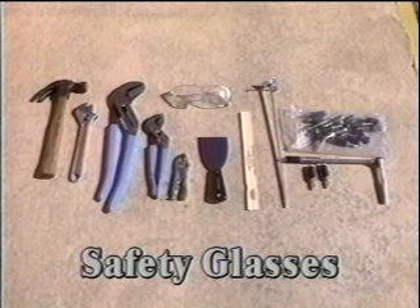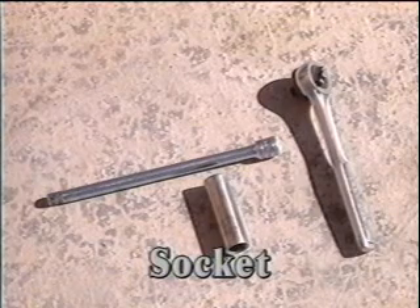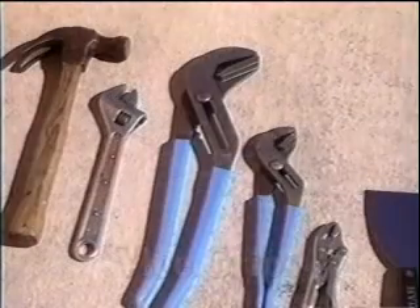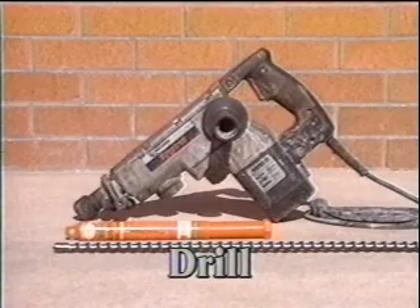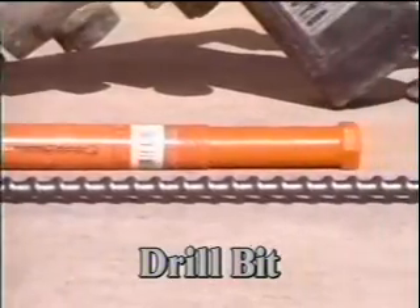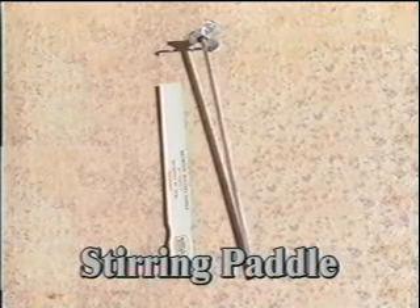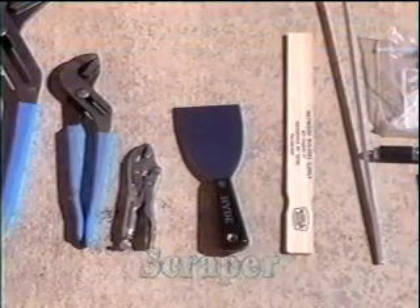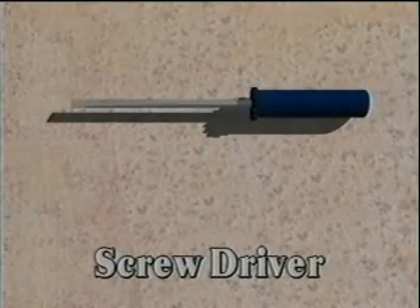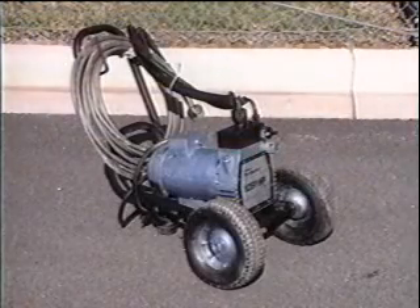This job will require the following tools: safety glasses, which are essential because of the high pressures in the pump and should also be worn when mixing material and drilling holes; a small ratchet for sinking packers along with a thin-walled deep-well socket to fit over the packers; pliers or vice grips; a good drill suitable for boring through concrete — we recommend a hammer drill such as a Macho II; a five-eighths inch drill bit at least 24 inches long; a paddle mixer and power drill for mixing, though the accelerator may be mixed by hand if unavailable; one or two clean dry five-gallon buckets; a scraper for cleanup; a small screwdriver for scraping around the packers; and a pump — most airless sprayers will work fine, typically called paint sprayers, and should generate at least 2000 PSI.